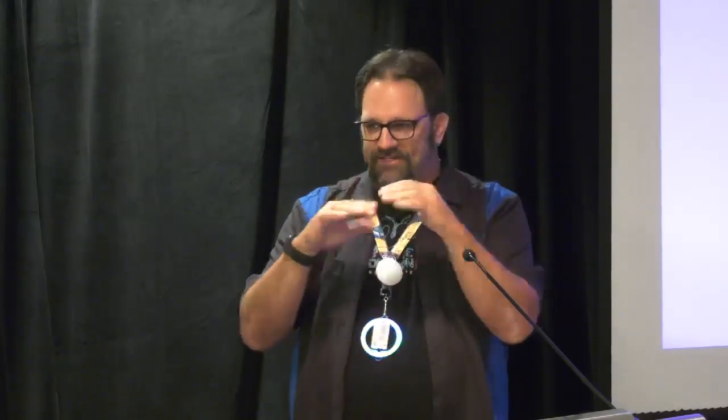The problem is that once you get close enough to the transmitter, your radio is at full quieting, which means it's a strong signal, and there's nothing you can do without some extra equipment to tell how strong it is. You get to a certain point where it's strong enough and you can't tell how strong it is above that. So once you get within a circle around the transmitter, it's hard to do any more direction finding that way.